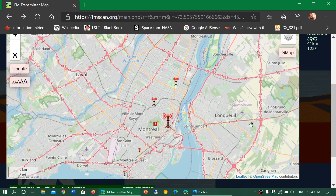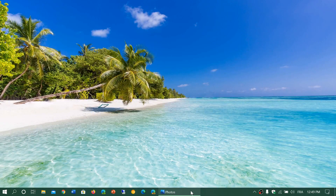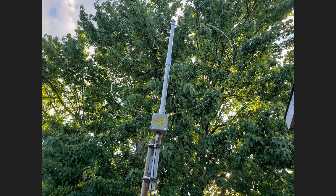The higher I go in frequency, the less breakthrough I get, and when I reach the VHF range — air band and above — I get fairly regular VHF reception. So it is definitely an antenna that's not capable of dealing with strong signals here; the amplifier is probably terribly overloaded. Yesterday I barely heard Voice of Turkey on 9830 kHz with it, while the MLA30 was giving me an excellent signal. Close to that frequency was a very strong spurious signal from an FM station here in Montreal, and because of that overload the sensitivity of the amplifier goes down.